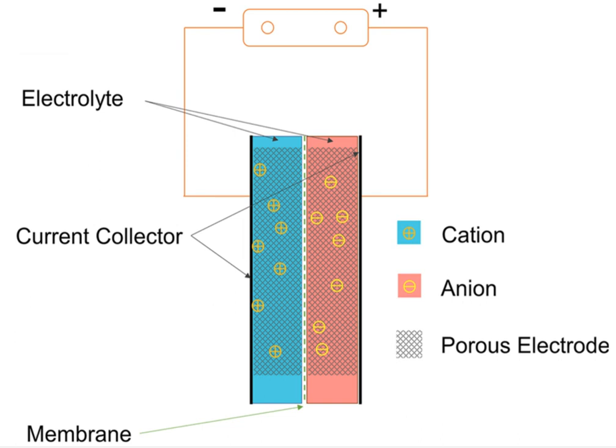Supercapacitors vary sufficiently that they are rarely interchangeable, especially those with higher specific energy. Applications range from low to high peak currents, requiring standardized test protocols. Test specifications and parameter requirements are specified in the generic specification IEC EN 62391-1, fixed electric double-layer capacitors for use in electronic equipment. The standard defines 4 application classes according to discharge current levels.